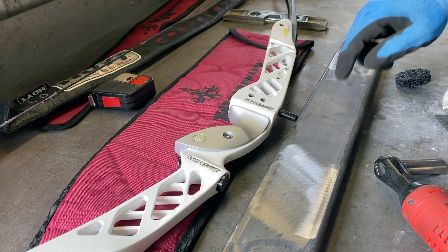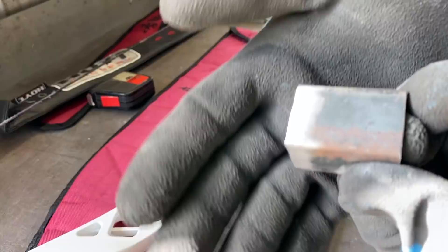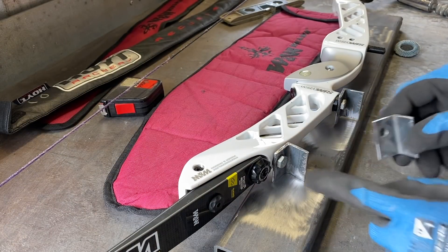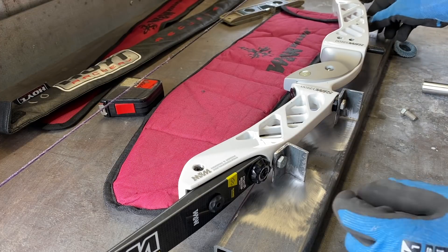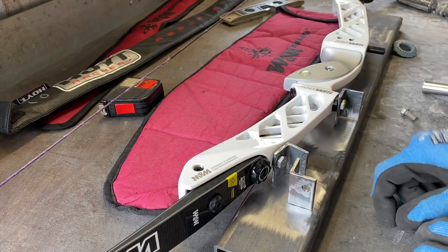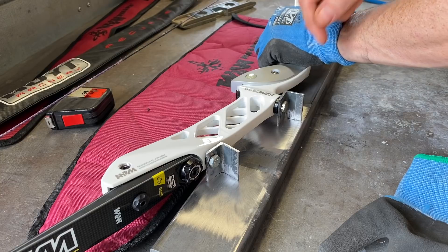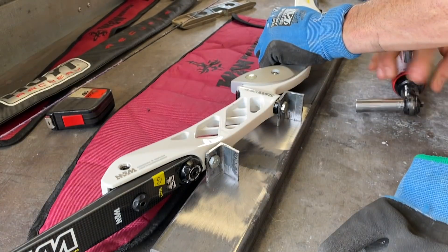I'm removing the mill scale from where I'm going to be welding and removing some burrs using a flap disc. I need to flip one bracket, drill a different hole on the other side, and weld it in for the top mount — because if it were the other way, the bracket would bump into the limb bolt. I re-drilled the hole, cleaned it up, and now have all three mounted. I'm snugging them down so they all sit flush, so when I weld them they'll stay in place, nice and flat and square, ensuring the riser bolts in without any issue.